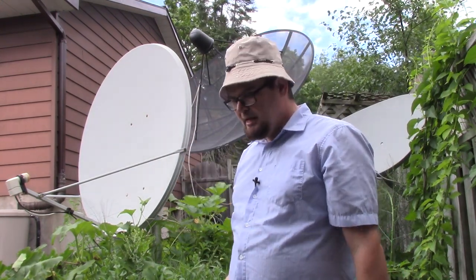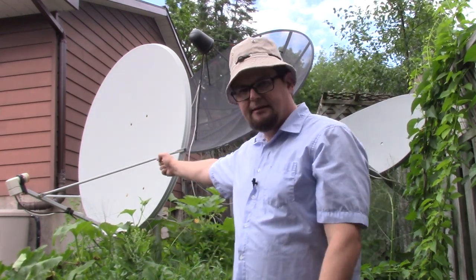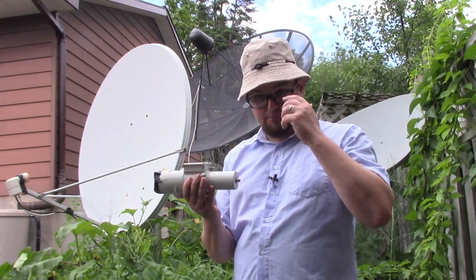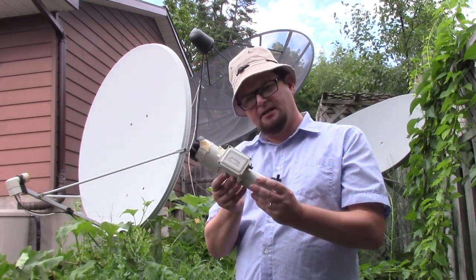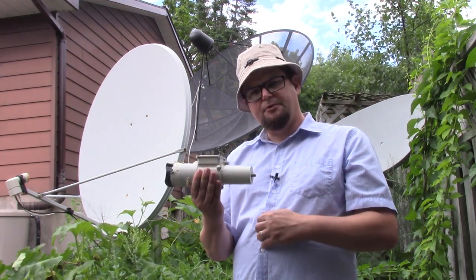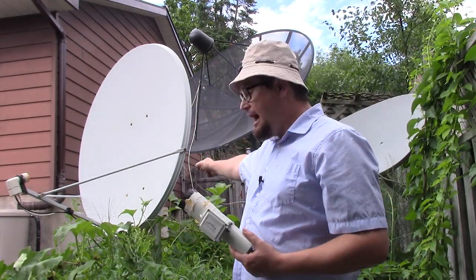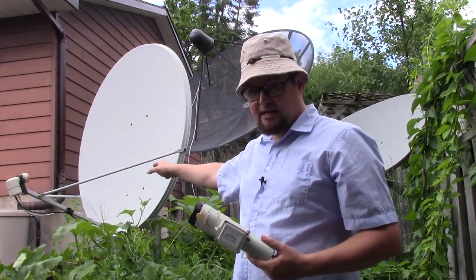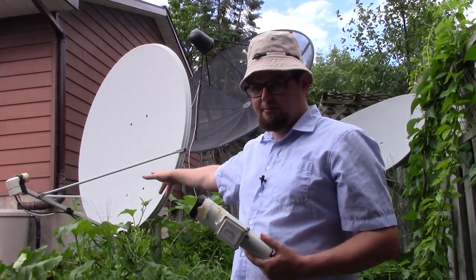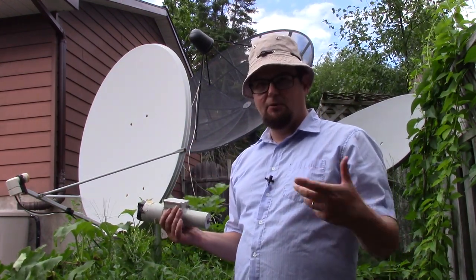So that brings me to this four foot dish. I did get C-band using this LNB on this dish, but the focal point took me a real long time. I would adjust the LNB and get the KU band working but lose the C-band, then adjust and get C-band but lose KU band. I still need to tweak with this. I got this dish set up for KU band — there are a few weak KU band transponders that I've locked on this, and I pretty much use this four foot dish for a few of the KU band channels that I want to get reliably.